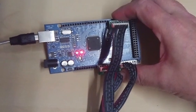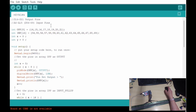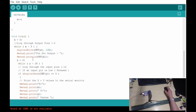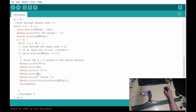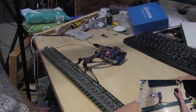I'm going to do this using this Arduino 2560 Mega. That's running a piece of code. It sets some output pins and then some input pins, sets the output pins as output in a little loop, and sets the input pins as input pull-up — which gives them pull-up resistors. Then it loops through the output pins: once it loops through one output pin, it reads all 16 input pins, then starts again with the next output pin and reads all 16 input pins again. Every time it steps through, it reads all 16 pins, steps through and reads all 16 pins. Then it outputs to the screen.